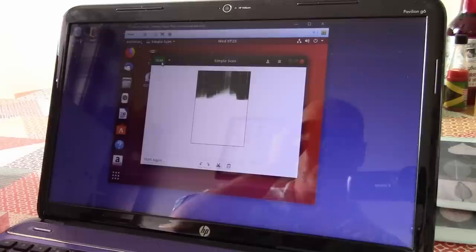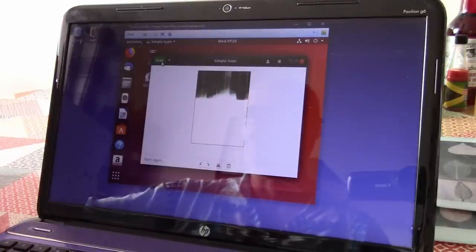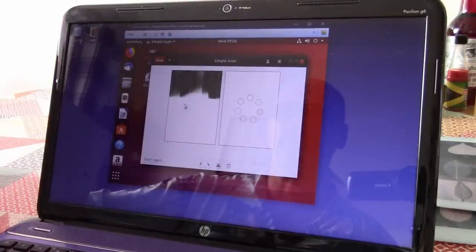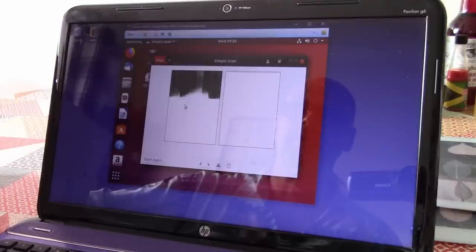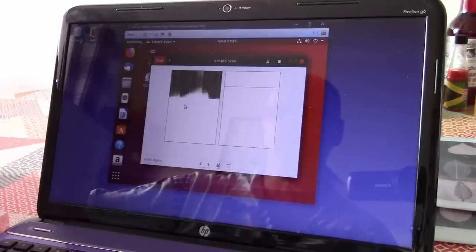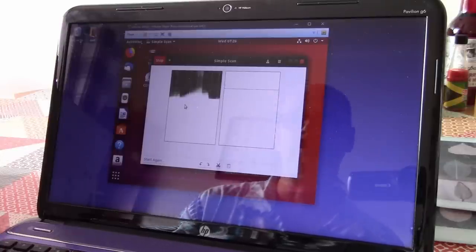Just one more thing to try, just to make sure this isn't just an abundance of light. I've got my finger over the pinhole now. Let's just try scanning again. Now, if the imaging component is working at all, we should just get plain black here. Ah, interesting. Plain white. That might mean it's trying to overcompensate for the exposure. Or it might just mean I've completely broken it.